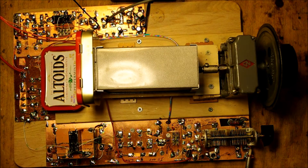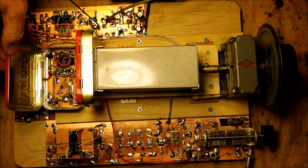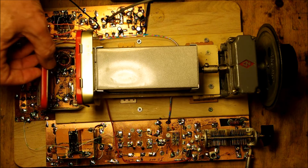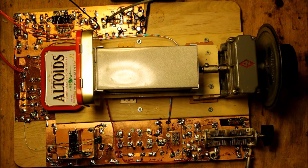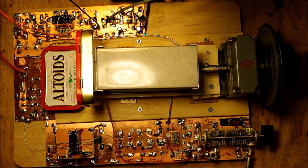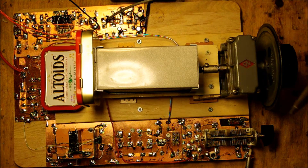This second Altoids box contains the buffer amp and the amplifier for the VFO circuitry. The separation seems to help by reducing heating on the elements that are determining the frequency of oscillation. The oscillator runs fairly high — in the 7.5 to 8 MHz range. The IF is at 455 kc, which I'll talk about in a minute, but let's go to the front end.